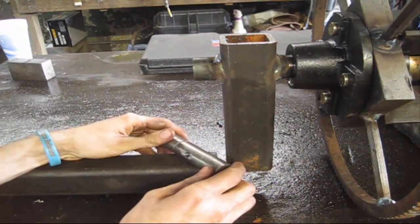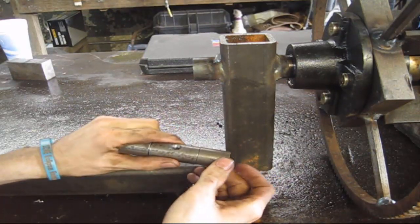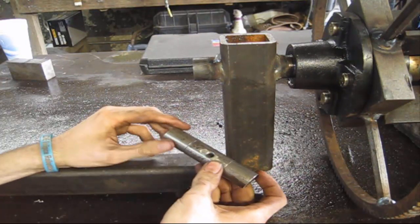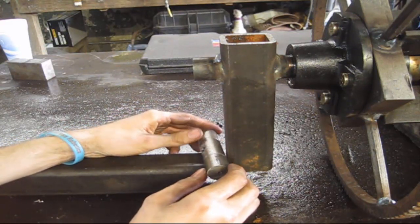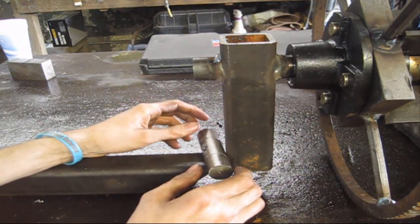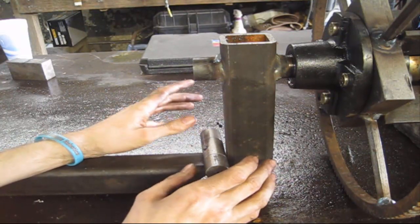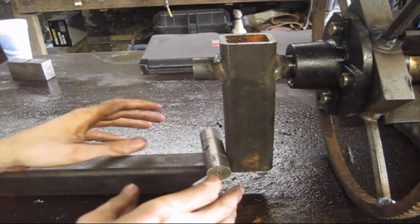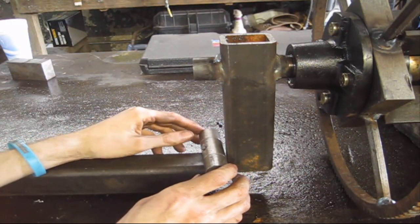One thing on these weld-on hinges, I've talked about this in a previous video, be sure you've got a lot of clearance in there. You can see how much. That's probably got 15-20 thou clearance in it. This one's a little tighter, I think. But the reason is, this is not a critical point. It's not going to be having an ungodly amount of load on it. So having slack like that, if it does decide to tweak on you whenever you weld it, it won't be hinge bound. It won't get locked up, froze up, is what I'm saying.